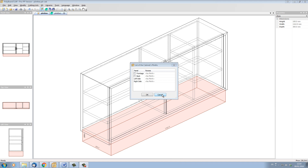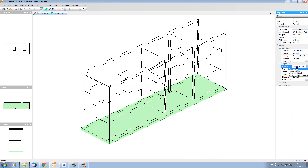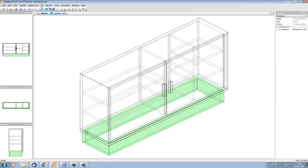So let's put the bottom of our cabinet overpassing our sides. I'm going to click the bottom of my cabinet on the right and left side — instead of underpassing I'm going to put overpassing, right side overpassing. And now if I click underneath my cabinet and add plinths, we can see we've got a tick box for the front, back, left, and right side, just like when we had a mitre joint. Let's put a plinth on the front and set it back 20, on the back I'll leave it flush, on the left set it back 20, on the right set it back 20. Polyboard automatically puts in plinths all around the bottom of our cabinet and the plinths are assembled with mitres.